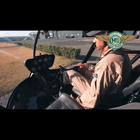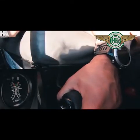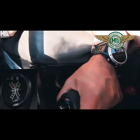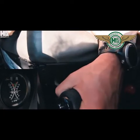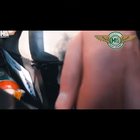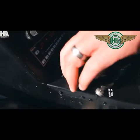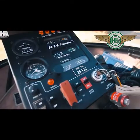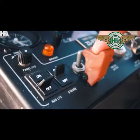Shutdown procedure. Close your throttle into the full detent. Hold it there until it hits 80%, otherwise it will run up to 100%. You can then bring it down to 70% and hold it there. Tighten your collective friction as well as your cyclic friction. Once you have a positive drop in cylinder head temperature, you can bring your throttle fully down and then disengage your clutch.